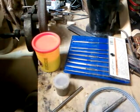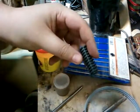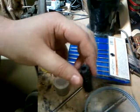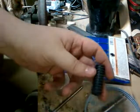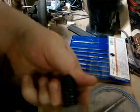I don't know if you can see it, but there's the Altoids tin. It burnt right through the tin — crap. After that little mishap, I stuck this back in the wood burner for about five minutes to get it bright orange, and then I quenched it in water, just swirling it around in a can of water. Now it actually has hardened it up.